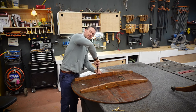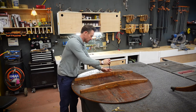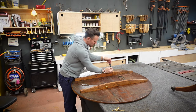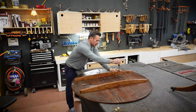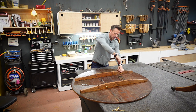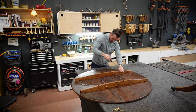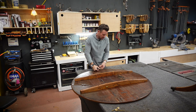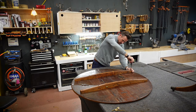Gluing together a round tabletop can be a little tricky to get clamps on it, especially if the joints have warped. If they have and you can't get a draw clamp on, the only way to really do it is to make a big jig that's going to encompass the sides and put pressure on the end. So we're going to have to have a jig that catches it from about halfway and go tight with the whole thing. I can see it's got a little bit of up-and-down movement too — it's not quite flush.